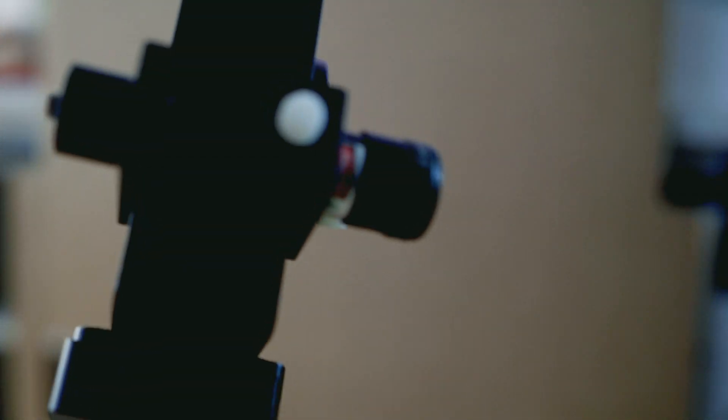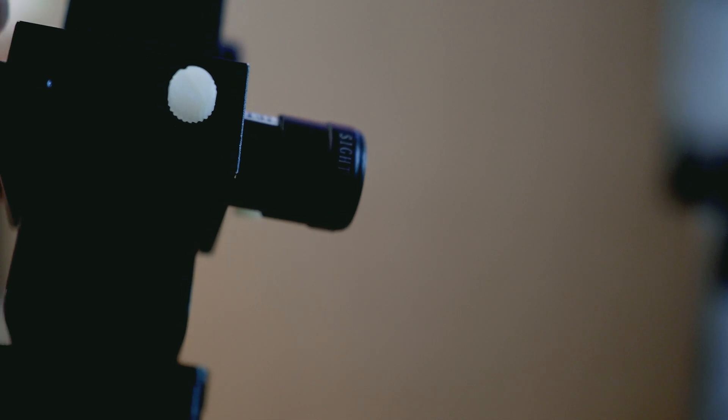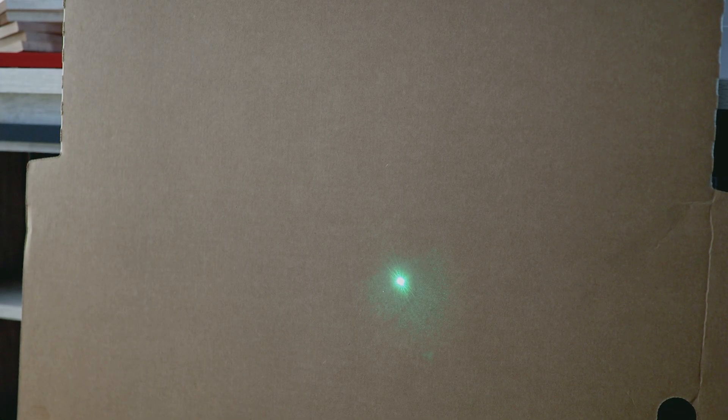In this case, I'm going to be using a large piece of cardboard. While testing the laser, you want to loosen the screw just enough so that the laser can spin freely in the bracket in a full 360 degrees. I've got my cardboard set up and my laser is mounted in the rotator and pointing at it. As you can see, while I'm rotating it in a circle, it's definitely not straight — see how it's moving like that?